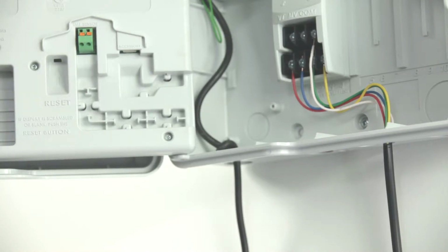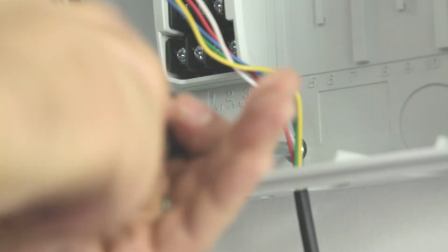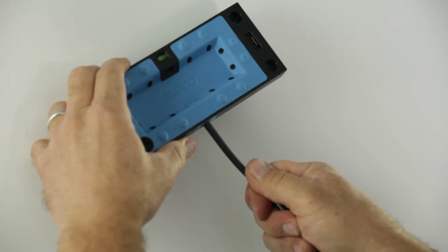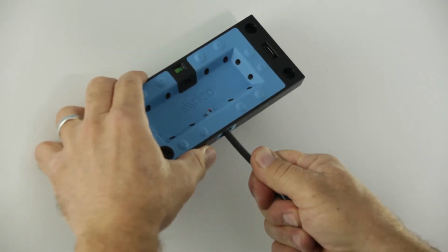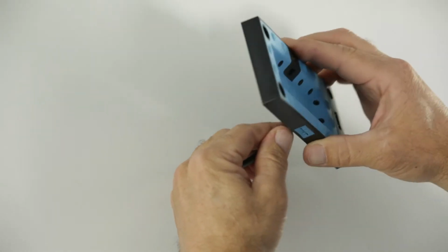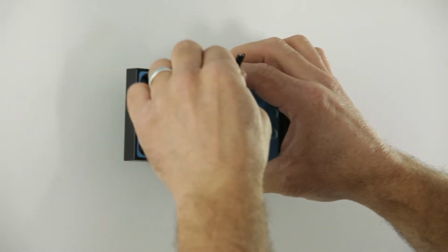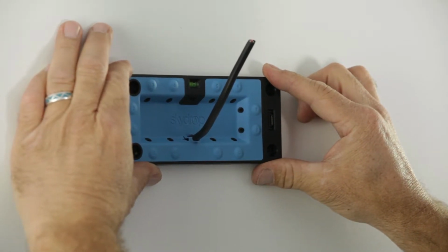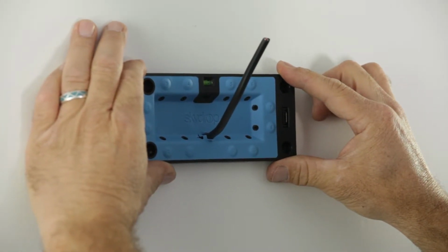If you are replacing an existing sprinkler controller, congrats! You already have a great location to mount your new Halo controller. Skydrop provides 2 ways to install your controller. You can run the wires through the bottom entry, or if your wires are coming through the wall, you can have them run directly into the back of the panel. Make sure you have pulled enough wire through that they can reach an inch above the mounted wall plate.